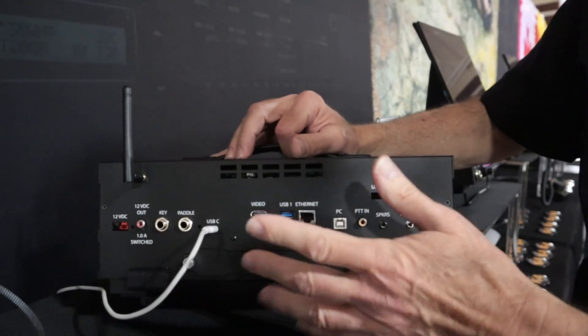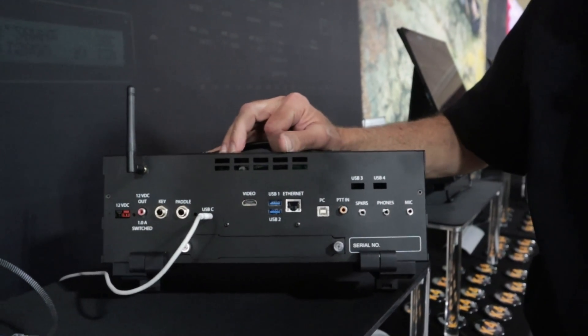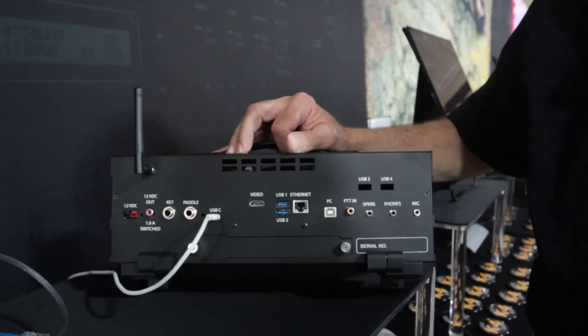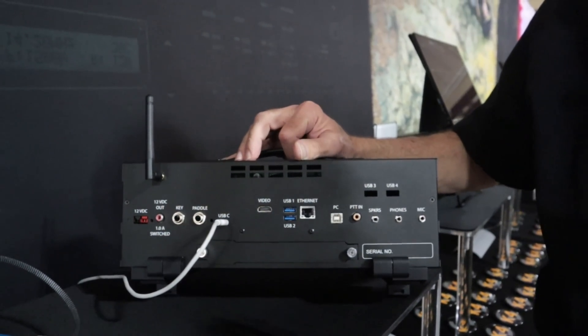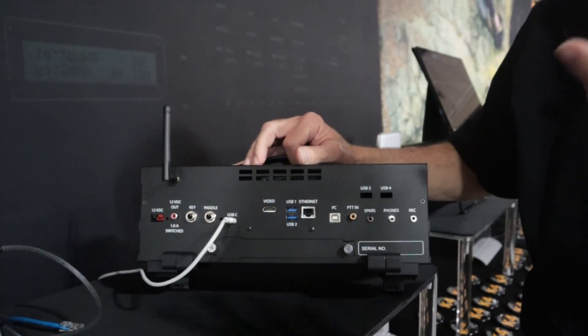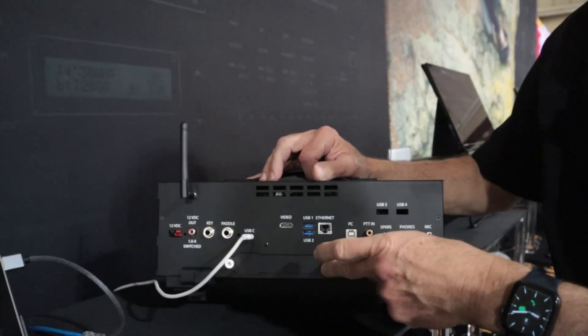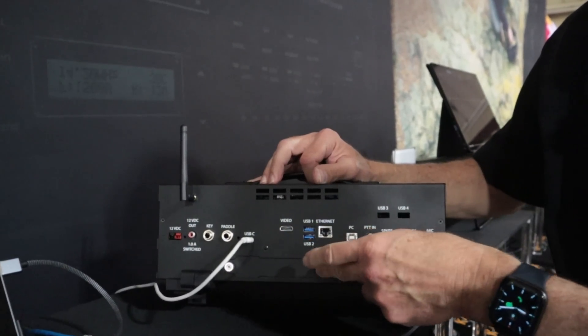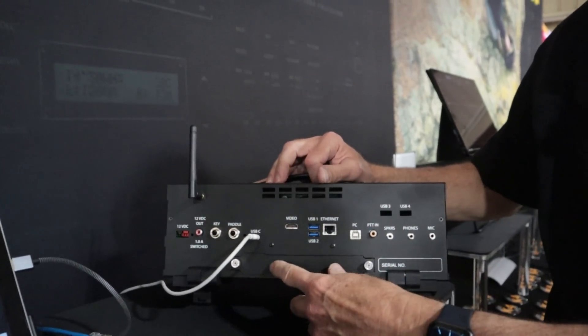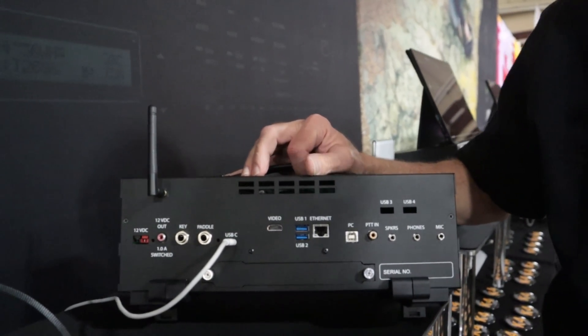Power poles for power — that's always there as legacy. If people have it in their house and want to plug it in, it'll run off 12 volts there. With the 30-watt wall wart, they negotiate a voltage via USB-C Power Delivery — it runs 15 volts at about 2 amps. But if you're going to charge the internal batteries while running the radio at the same time, that requires a 45-watt one. But they're all small.